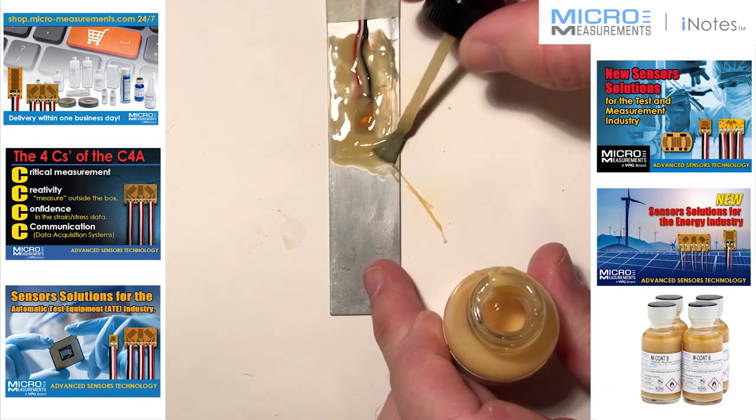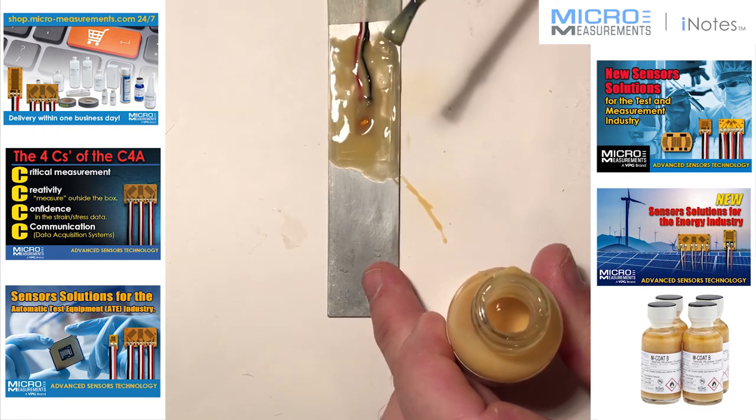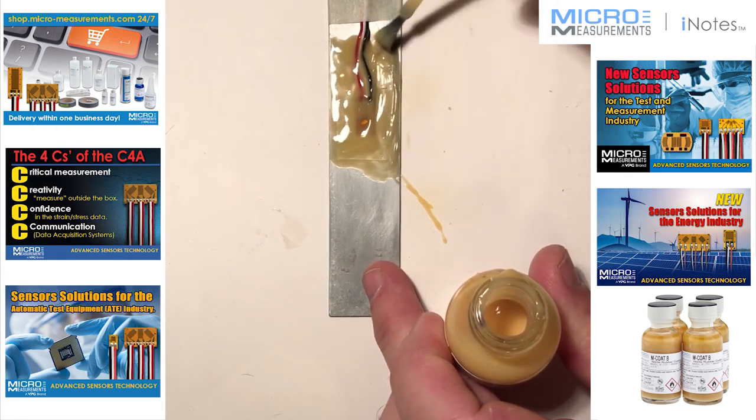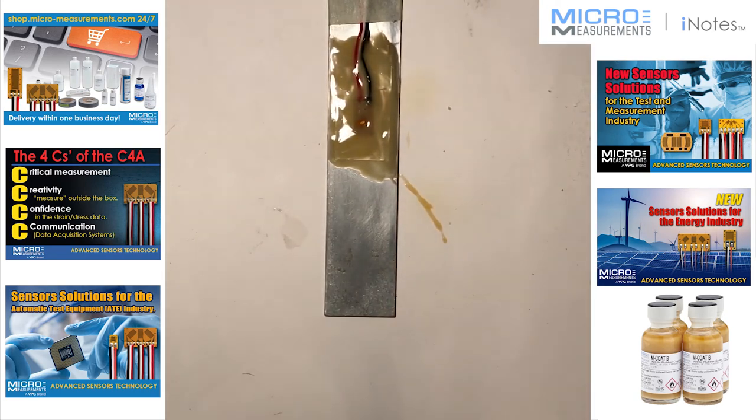and you just paint it on, and you let it air dry for at least an hour before use. 2 hours if you're going to put another coating of M-Coat B on top of it. The normal cure is 24 hours. And after it dries, you have an outstanding coating to protect your gage.